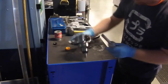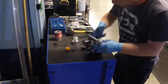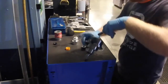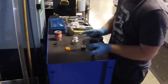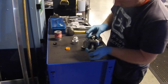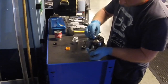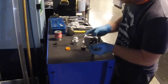Give the races a quick smear of grease. This one goes in from this way, and as you're doing it you need to thread on the gear, because that gear can't go through where the bearing race is — which is a bit of an oversight to be honest. They could have made the gear teeth a little bit smaller so it would fit through, but you know, you're not here to make life easy.